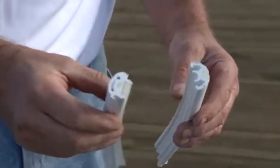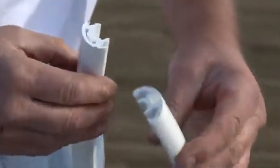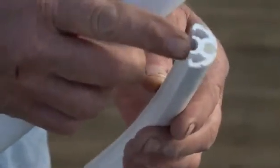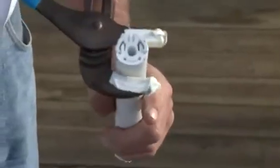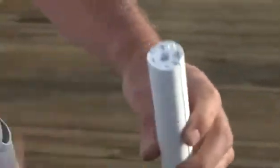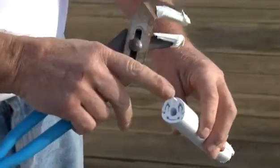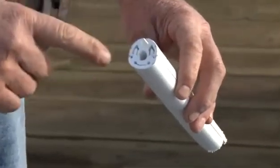Here is an end view of the two extrusions. This is the forward extrusion, which does not have the sail groove in it. This is the aft extrusion, which does have the sail groove — it has the teeth that lock into the grooves on either side. They go together like this and with a little bit of pressure they snap together pretty easily. You can hear it clicking as it goes down, forming a one-piece extrusion with a sail groove at the back. The hollow inside accommodates the headstay itself — it doesn't need lubrication, it won't corrode, and it forms its own bearing against the wire.